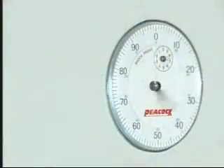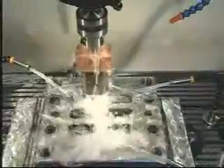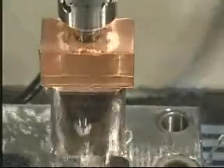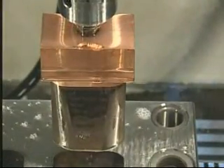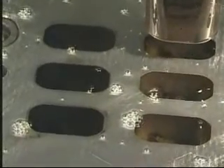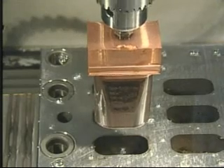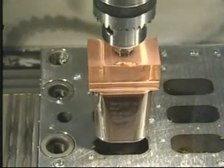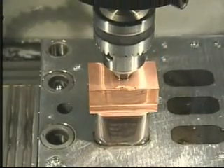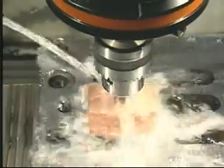CNC 540 and X600 uses high-precision linear guideways and ball screws for three axes to ensure long-term accuracy. Those parts include ball bearings and are selected to meet the requirements for heavy-load electrode and big work pieces. They are also driven by powerful servo amp and linear pulse scales to achieve very good accuracy on all of the axes.